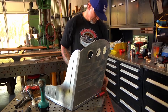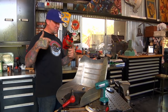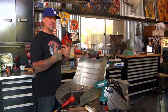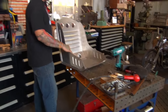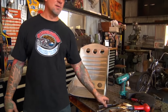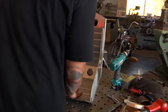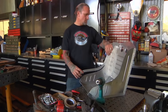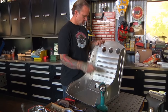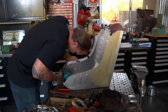There's a good feeling when you get a good rivet. It's only moving like not even a sixteenth of an inch, but when you feel it — just — you can feel the metal tighten up and everything squeeze together, that's like the sweet spot. The twist is totally gone now, there's no wobble and it sits flat and it's strong. Putting the side, top, and bottom pieces on is only going to make it stronger. It's not any one thing that makes it strong — it's everything working together as a unit.